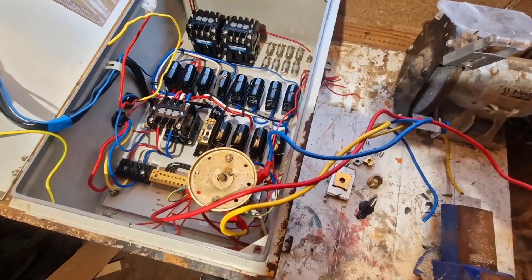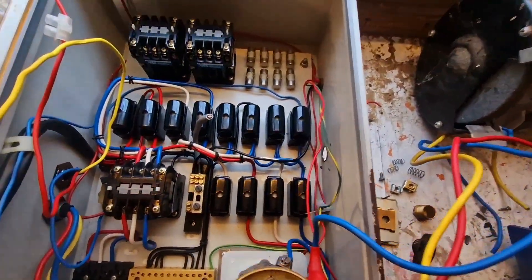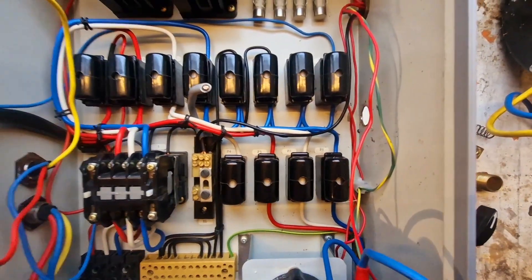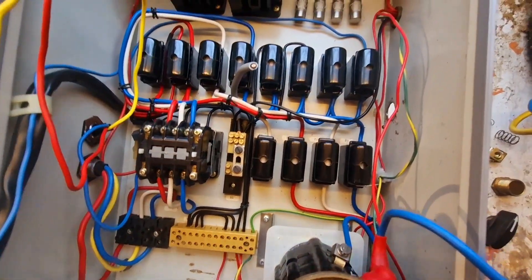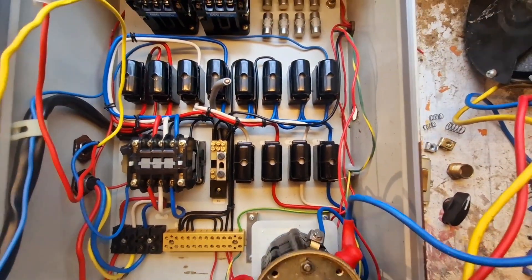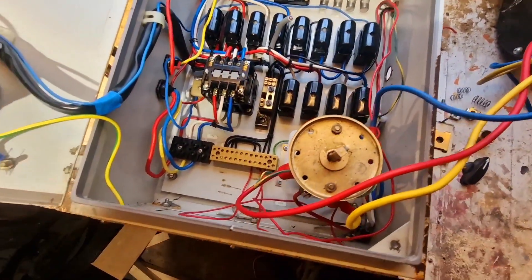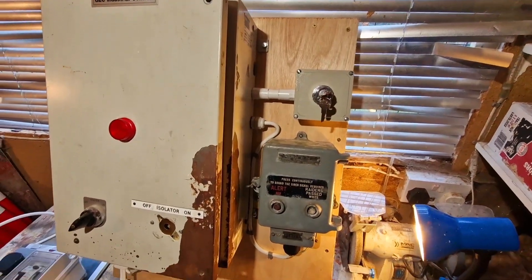The plan going forward with this control panel: we're going to strip out some of these cut-off cables. The remote control start and the test button push switch are all wired on the blue phase, and that does seem to be the phase supplying the siren contactor. We'll be able to put a 240-volt supply onto the blue phase and should be able to test the contactor functions. We will wire on a test key switch so it can be activated by the owner when they want to sound the siren, and it will eventually be hooked up to a three-phase supply on their site.